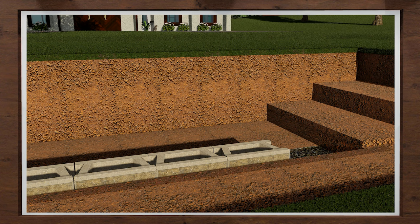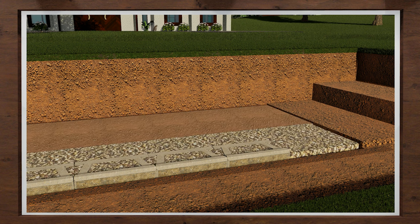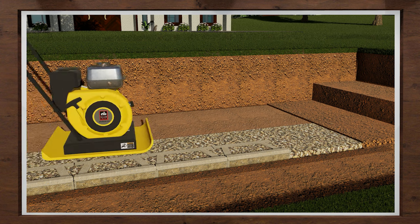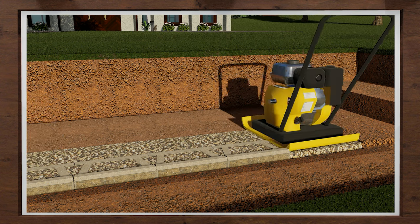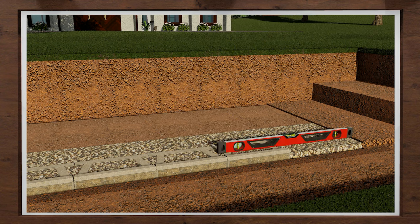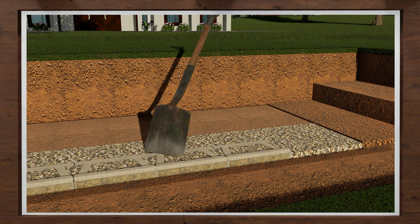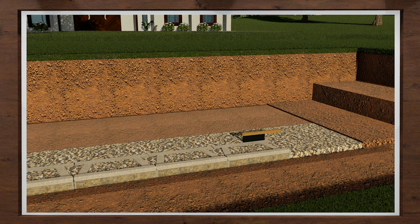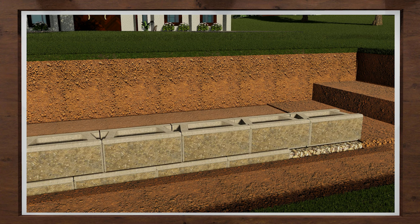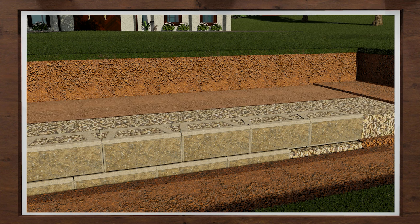You want to fill in the front of the block with on-site soils. You will then fill the course and 12 inches behind with wall rock. Typically on-site soils can be used behind the wall rock. Then compact the entire area starting directly behind the block and working into the backfill area. In the step up location, ensure the wall rock is level and compacted but make sure you don't move the block of the base course. Install your second course and remember to offset by at least a quarter of the block length. As you transition from the block to the rock, follow the base course installation steps. Sight down the wall and make any adjustments needed to ensure they are level and aligned.